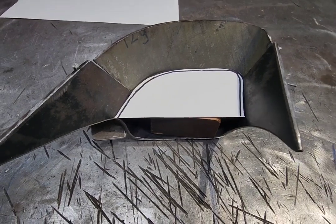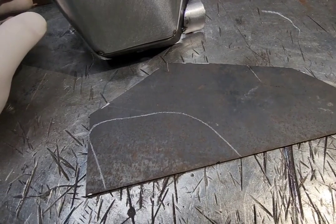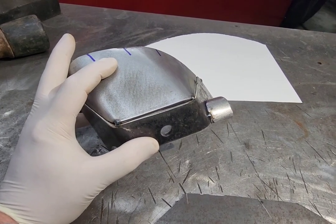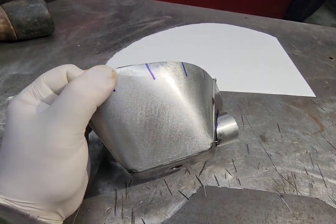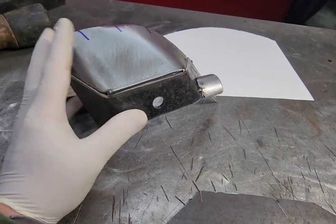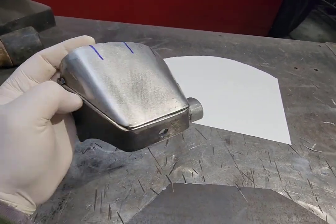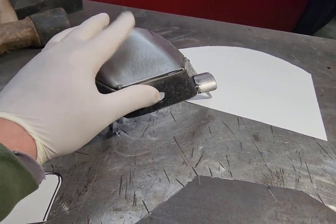Let's trace this to metal and get it fit in there. I got it traced out. One thing I want to cover that I forgot in the other video: when I started making this top plate, I was going to attempt to make it out of 3/16ths, but I realized it would have been harder and probably overkill, so I ended up using an eighth-inch plate for the top piece. I think that's fine because it's just supporting this — it's going to be fully welded to the frame.